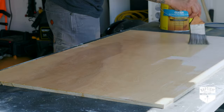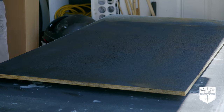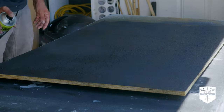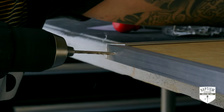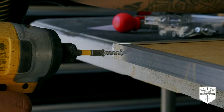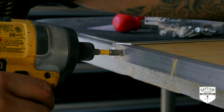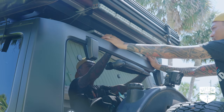To protect the table, I covered both surfaces with a water sealant. Then on one side, I spray painted the truck bed coating to see how the finish will turn out — more on that later. Once the table dried, I installed the aluminum edging with some screws, making sure to countersink the holes because we don't want any screw heads sticking out that might get caught in the rails. From there, it's just one more final test fit to make sure it all slides smoothly.